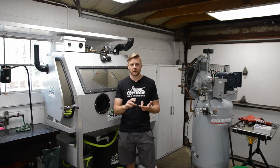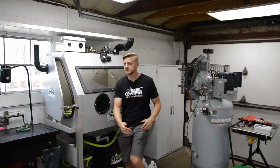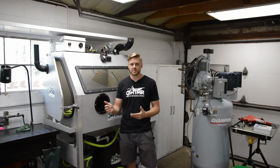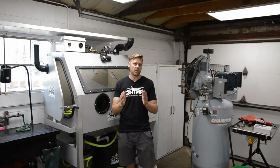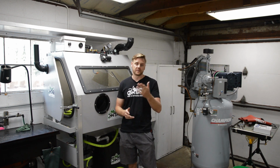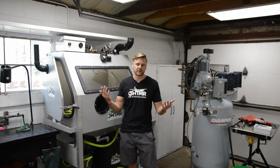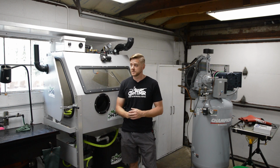So I like to do this test from 80 to maybe 120, okay? Because that's where your CFM is going to be the highest. That's where it's going to be operating when it's blasting. So you can run through that formula, and that's a great formula and a health check for your compressor because, hey, let's face it, the pumps wear out or the reeds get dirty, the disc valves get dirty or whatever. So you want to get a baseline for your compressor if you have no idea how it works or if it's new to you. My old pump on this compressor was putting out half the CFM because it had a bad valve or whatever, and I couldn't fix it. Parts were obsolete. Got a new pump. Bam, I'm up to the rated spec.